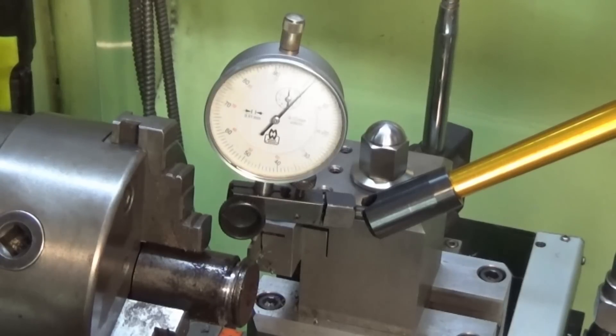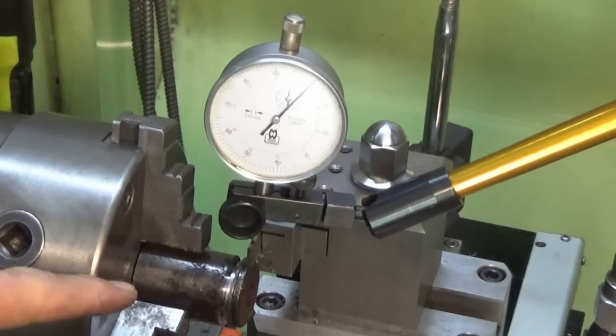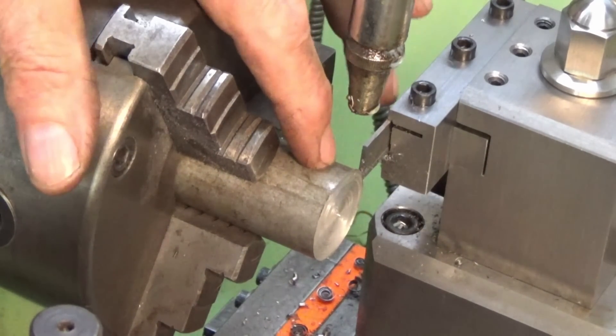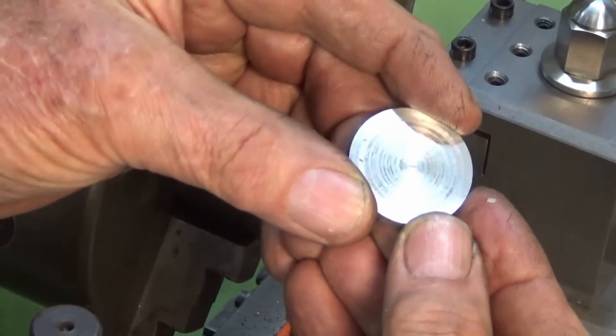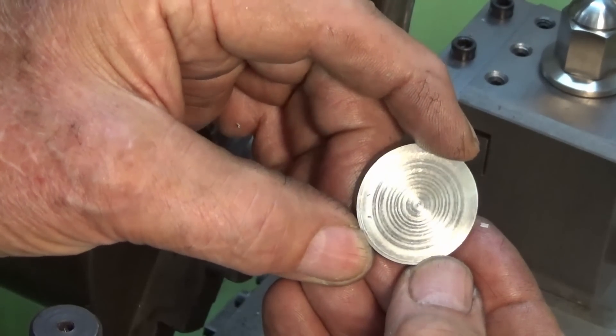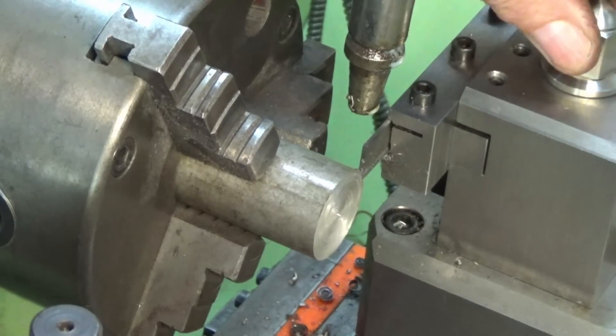In a way that's the self-regulating thing happening — if you do overload the tip of the blade it should lift up and flex away from the interface between the tip and the material, which gives you reassurance that you're not going to pull the blade into the cut and snap it off. Now I'm going to put a piece of aluminium in here and cut off an entire slice to see if we still get that funny pattern. This is the same stock from the third build video — there was a concentric ring pattern on the surface but also a very faint radial pattern as well.